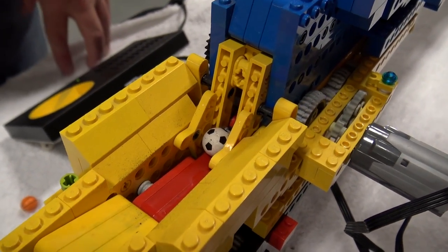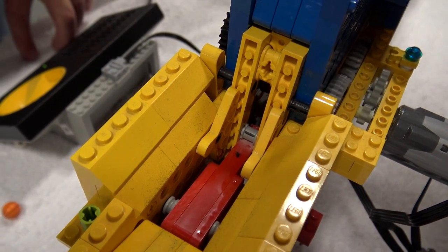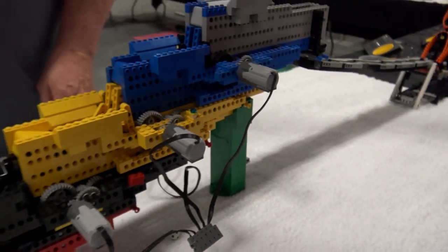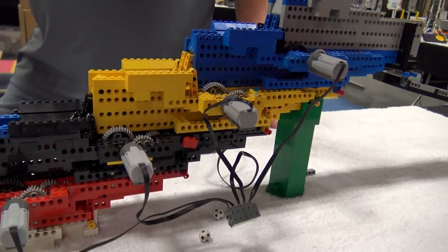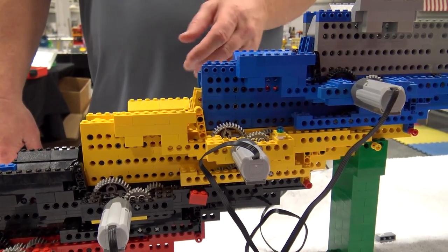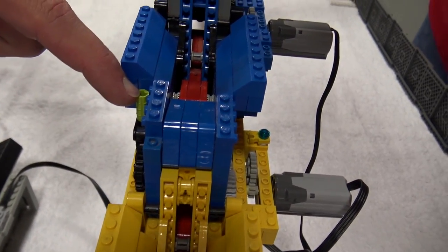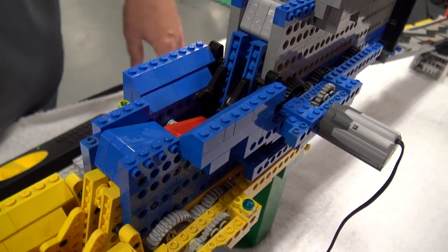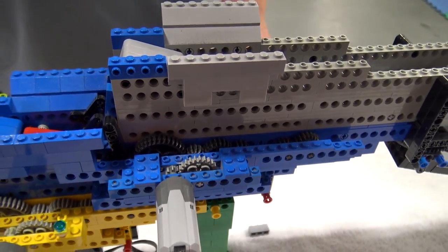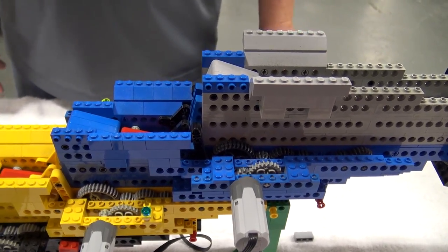There's a lift arm that spins around and pulls down on the red beam, which is sprung, and it slips off it and does a little push. So the interesting thing about this module is that it has the ability to adjust the phase between each of the poppers so that I can get them all to launch at the same time. I can tweak it a little bit, and also the ability to adjust the tension of the springs so I can adjust the height that they jump. While all that flexibility is really neat, that's more stuff that wears out. So this module needs some part replacement. It does get a little wonky sometimes. It seemed to work fine today, which kind of surprised me, to be honest with you.